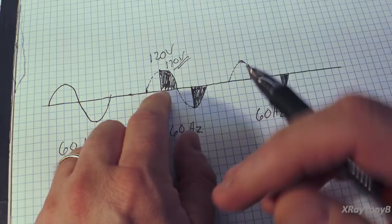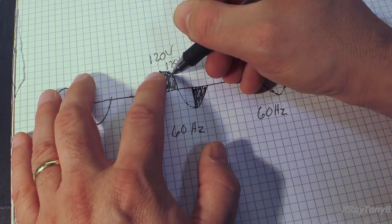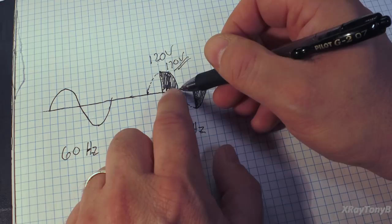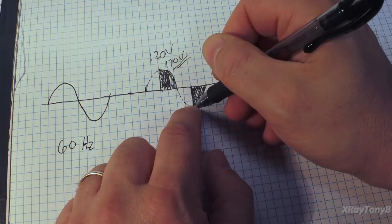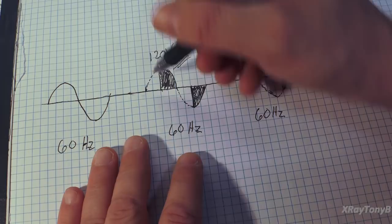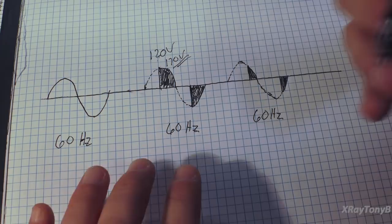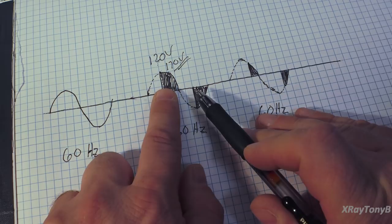At that point, the TRIAC will stay on, and as the mains voltage starts to diminish and go back towards zero, everything will settle back down. The same thing happens when the poles reverse - there will be a wait period until the circuit senses the peak, fires the TRIAC again, and dumps all of that energy at once into the coil in the opposite direction. So it is not a high frequency transformer. A lot of people make the mistake of saying it's a high frequency transformer that can't work at mains. Remember, this is still 60Hz, occurring 60 times per second, and each cycle is still only 1/120th of a second. It's just not turned on for the entire 1/120th of a second.